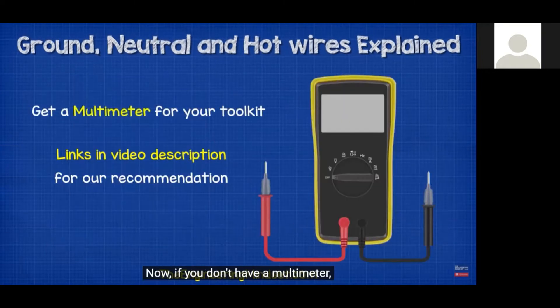To avoid ground faults, first use bushings and grommets. If you're going into a conduit stub, use bushings — little white caps that go over the end of the pipe — to keep the sharp metal edge of cut pipe from cutting into our wire. All conduit is grounded because electrical wires can make contact with it. So conduit, structural steel, water pipes, sprinkler pipes, wall studs, and ceiling grids can all have ground reference. We want to put a barrier between those and our wire. Where we go into 1900 boxes or 4-0 boxes and use the knockout, put knockout bushings in as a barrier. Don't skip this step — it saves time and money in the long run.